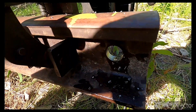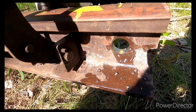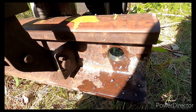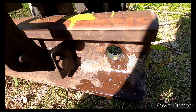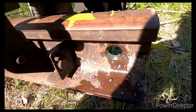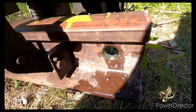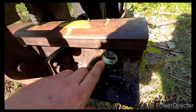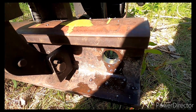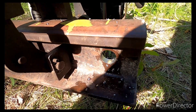When we're all done drilling, I'll take a peener or a reamer and ream the hole out around the edge. That's to keep it from — if it did get a little warm when drilling, this drill maybe increases the temperature of the steel maybe 25 to 50 degrees — the peener will take the sharp edge off and avoid small cracks that a human eye can't see, to keep the rail in winter from breaking and causing a bolt hole break.